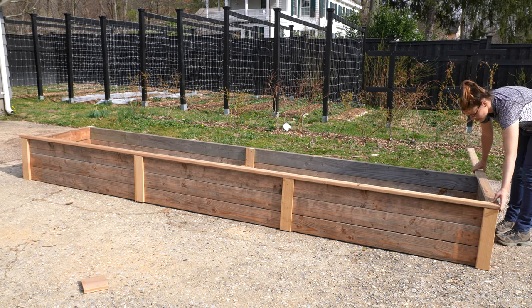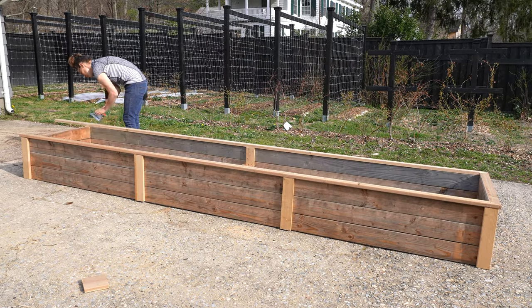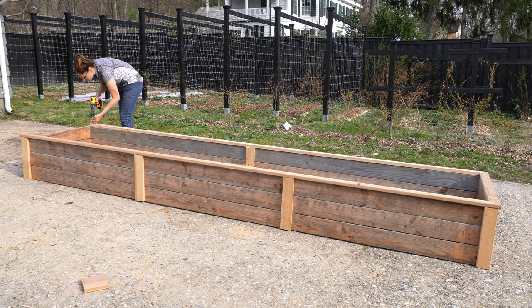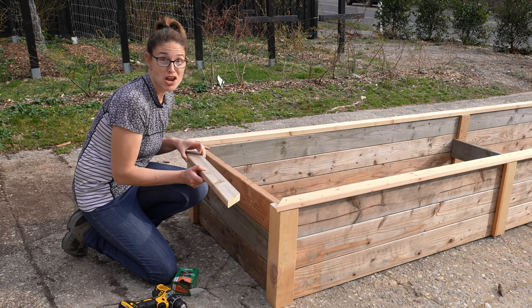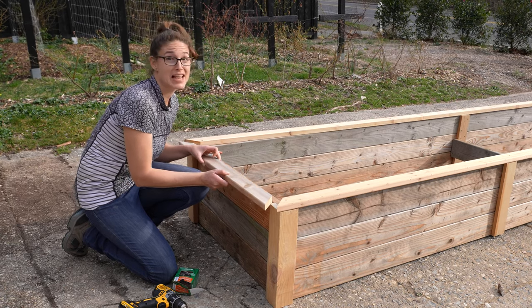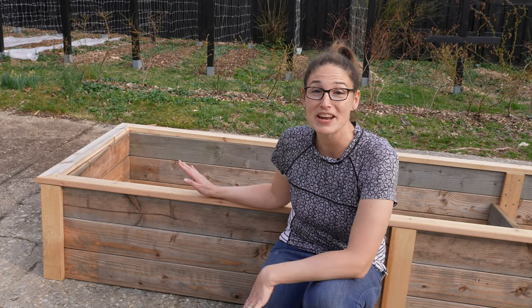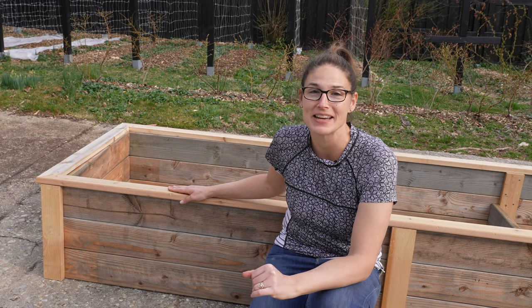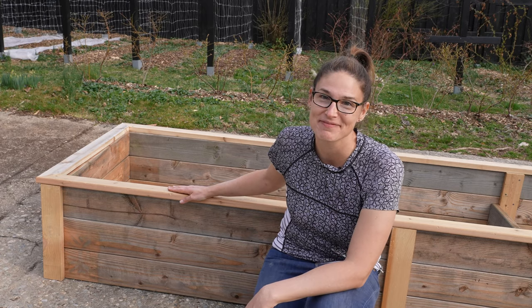Now follow along the edge of the bed in a circle, following the same procedure. Fit the railing on one end, mark the miter on the other end, cut and screw. Now, if you are a super pro, the last one is just gonna slide in like butter, baby. Oh yeah. So we are all done. You can enjoy this as is in its natural state, or you can stick around with me to my next video where I waterproof this and stain this black like the rest of my beds.